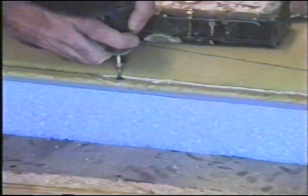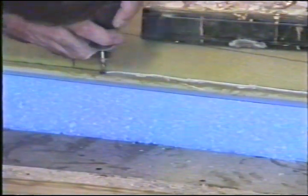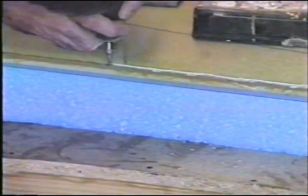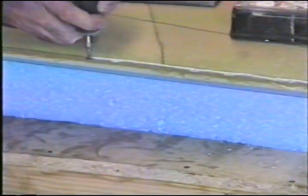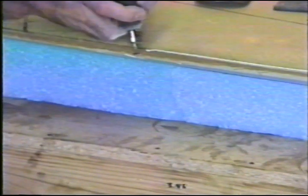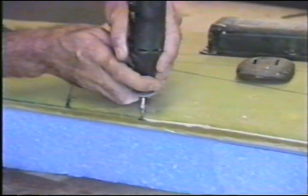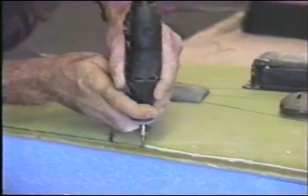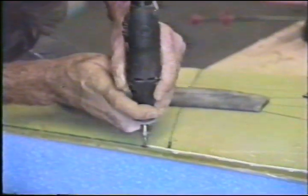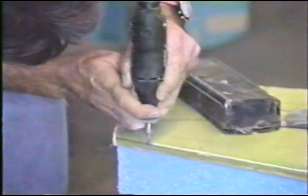After this cutting, we sand up from the cut, starting at about ½ inch or so, where we actually taper from that ½ inch point, sanding very little right to the center line of the leading edge, where we taper it to nearly nothing. You also sand 2 inches after the cut line in preparation for bonding the top skin wrapping around the leading edge. We had masking tape underneath this, which makes a nice release.